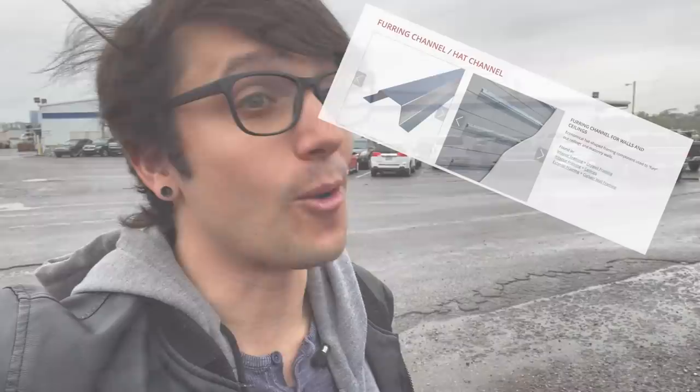I'll see you at the end to tell you about something really exciting. Updating the vlog — I have driven into Nashville. I ordered all of the drywall. The guy that set up the order had added all of this stuff called furring channel, but they didn't have the right gauge at the drywall place, so I'm picking it up here in town. It's a 25 gauge — I'll explain what that is. I'm looking for 7/8 inch 25 gauge furring or hat channel.